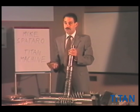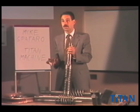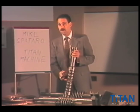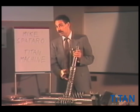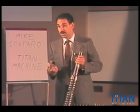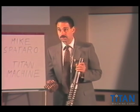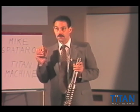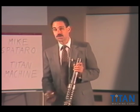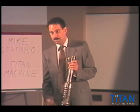What I've been told is it sounds like there's a bad thrust bearing in the machine — I've heard that from a number of people when they send in the worm and gear. But this is a very hazardous situation. You could have a free-fall situation; someone could really get hurt. I bring it here to show you this could happen. If you're going to inspect machines, certainly go a little step further. I'm talking about salespeople — when they go and look and say that gear looks fine, they're not looking below. It's worth the extra time if you're going to take on a contract or quote something.